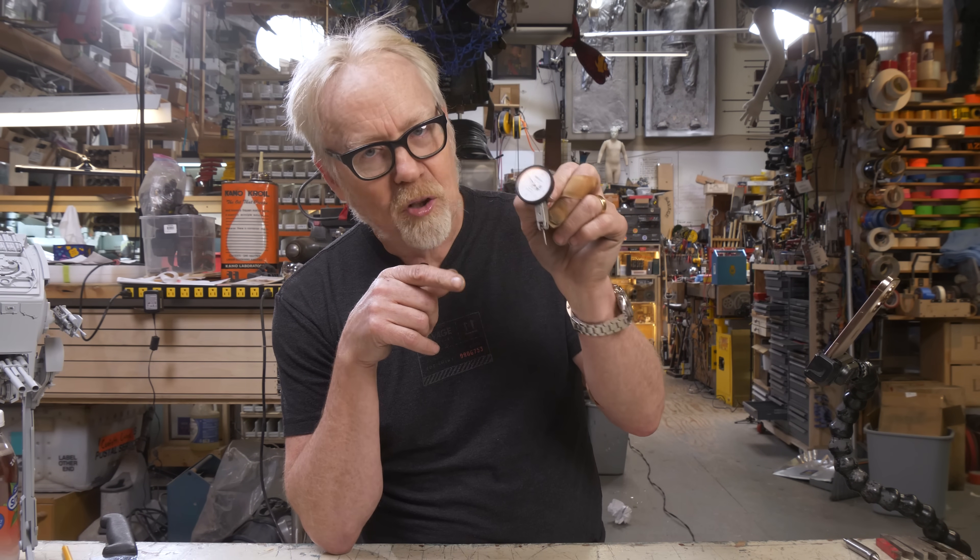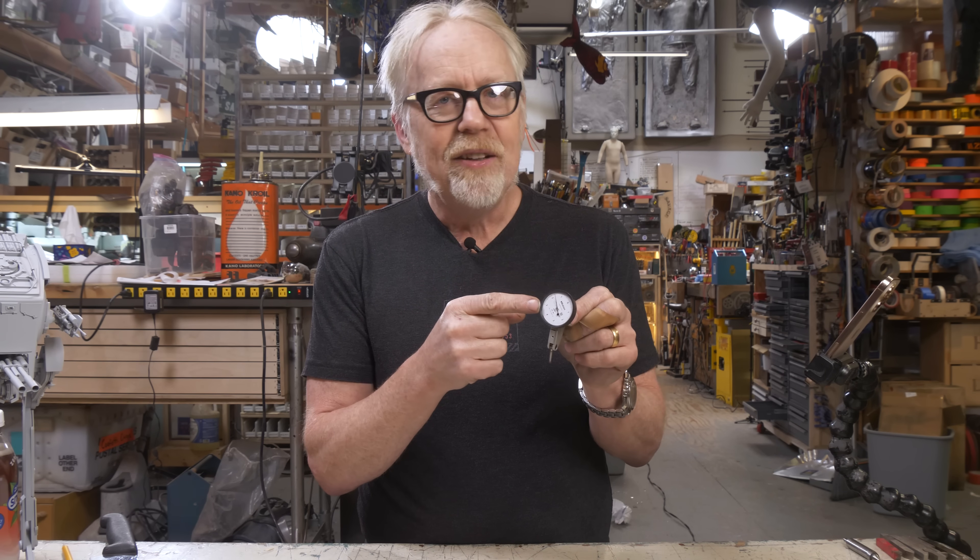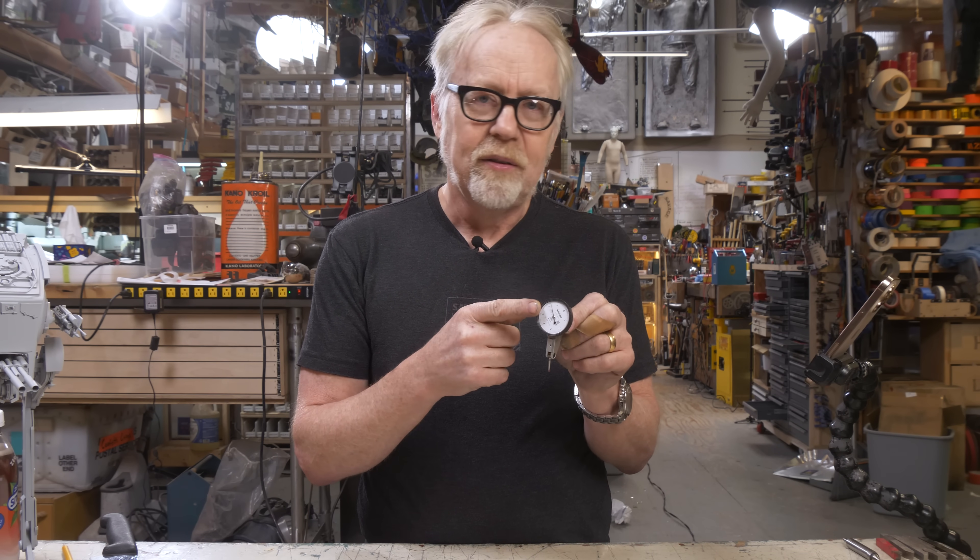These gauges don't have to cost that much. If you're a beginning machinist or machine operator — and since you're called Scaled Creations, I'm guessing you're milling small things and not necessarily out of hardened steel — I found one of these on Amazon, which we'll post in the description, for thirty bucks. That'll be accurate to within a thousandth, give or take. That's plenty for model work. Plenty.